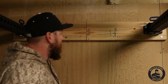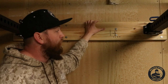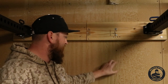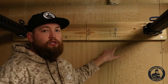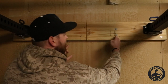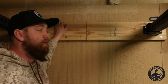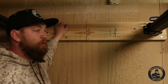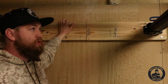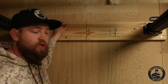The other way to find studs if you can't find any screws: studs are 16 on center, meaning from the middle of one stud to the middle of the next is 16 inches. It actually says 'stud' on your measuring tape in red instead of black. So that's the stringer portion — next we'll talk about rack height.